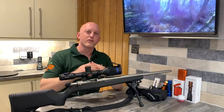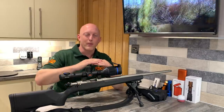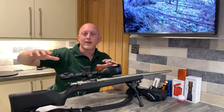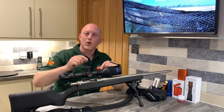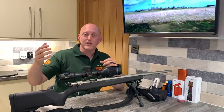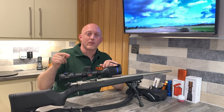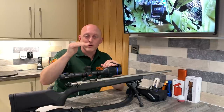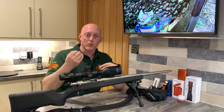Let me give you a scenario where those two differences would actually make quite a big difference. If you're out looking for a deer on a dewy morning, when moisture is over everything — over the grass, over the trees, over the rocks — because of the moisture and because it's been there all night, effectively everything's going to look the same temperature through a conventional thermal riflescope. I know that with the old Accolades, if you went out on a very humid evening or in dewy conditions, the atmospheric conditions meant that everything looked rather hazy. The sub-25 millikelvin sensor, being more sensitive to those differences in temperature, means it's able to depict them and display them on the super AMOLED display, meaning that you can still see outlines of trees and foliage — and then of course when you get the heat source of an animal walking by, it shines up like a beacon of light.